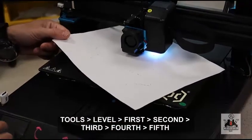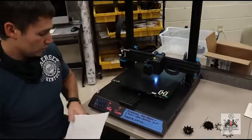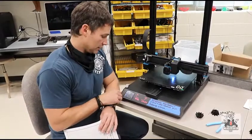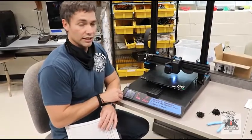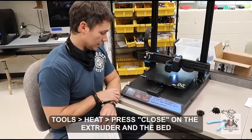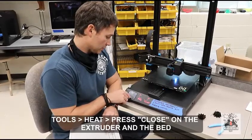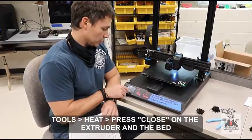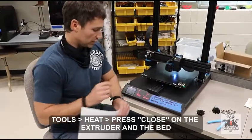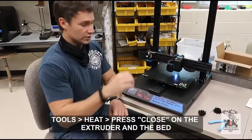At this point I'll go ahead and make sure I get my extruder off the build plate, and also go back and make sure that I turn off my preheat. Hit the close button on the preheat and actually make it go off so that you're nice and safe and your printer is cooling back down. Be careful with the Sidewinder — sometimes you have to tell it to close both the extruder option and the bed option to make sure they're both set to zero. You can tell that by reading whether zero is set to the right side of the temperature display.